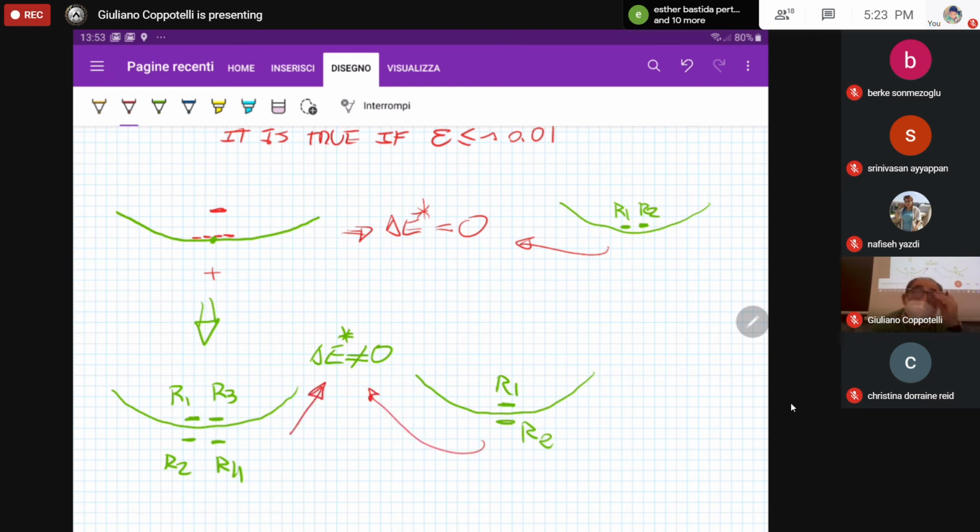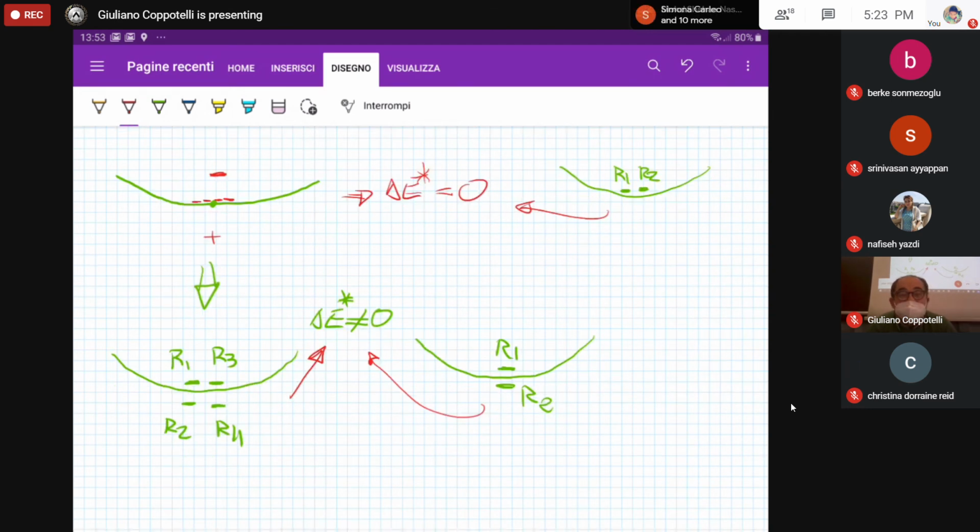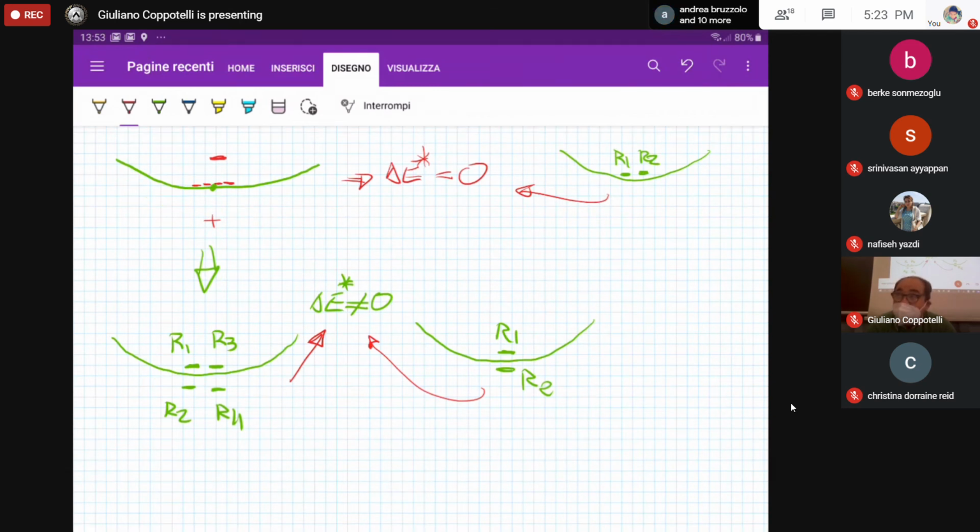Okay, so that's the reason why, when locating and using the strain gauges, you have to know what type of strain is characterizing your measurement in your structure. Then you have to use a proper number of strain gauges so that it maximizes as much as possible the sensitivity of the measurement. We are going to see that in a few seconds. But you also have to take into account what's happening there in order not to have zero output tension, so your measurement is completely useless.